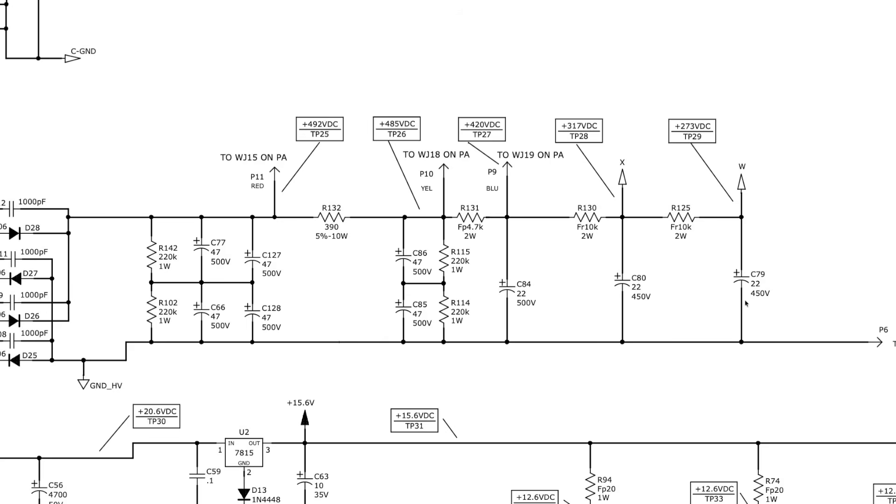For these last few nodes they've dropped down to 450 volts — you could use 500 volt caps all the way through, but 450 volt ones are a few cents cheaper, no problem there. This is one of the reasons I would never choose to run an amp with no tubes, because if nothing in the amplifier is drawing current those voltages will not drop — the B+ will just sit right across the whole amp, which is very stressful for your components. My advice: always keep your preamp tubes in at a minimum if you're doing testing.